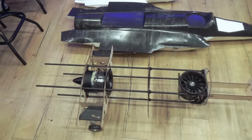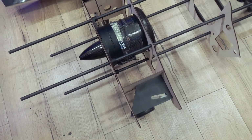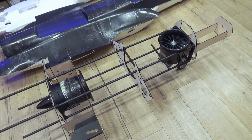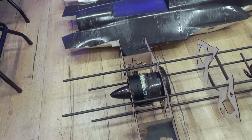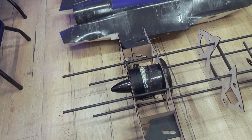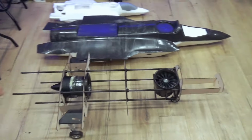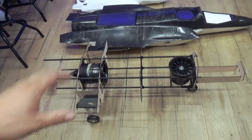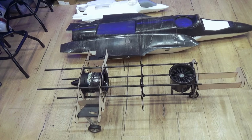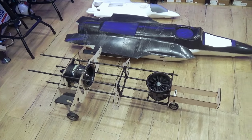Our next step is to build the 3BSM unit. We're going to use bleed air to guide air into the wing for roll control. We're going to use thrust differential between the front and the back EDF for pitching. And we will tilt the entire duct for the Z-axis, so yaw control. And hopefully we stay around 10 kilos. So what we need to do is finish up all the plans, the doors, the mechanisms. But first we need to hover it before we can continue our design plan and see how much it can lift. And it's going to be high voltage, 12S, so 4 minutes should be reachable for hover.